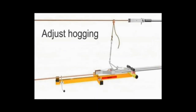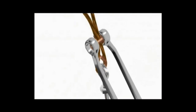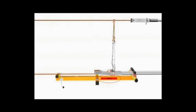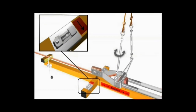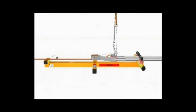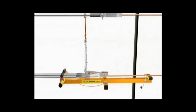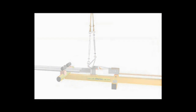This can be done first with the help of droppers to get the desired hogging level. With these four droppers we will adjust the hogging and fix the screws. Now take out the jig and adjust the turnbuckle so that the level comes to the center, ensuring that our neutral section is coming in parallel to the track. Then go to the other element, where the direction has changed from red to yellow, and again adjust the turnbuckle so that the levels come to the center, leveling our neutral section body with the track.